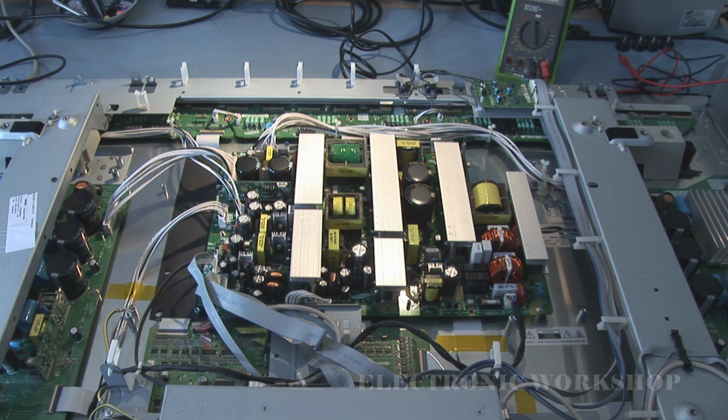Okay. Hard to know. I'll have to get it up on its side. I can hear it responding to the remote on and off. I can hear transformers on the Y sus and the Z sus PCB running. So what I'll do now is reposition the unit and have a look at it when it's upright.